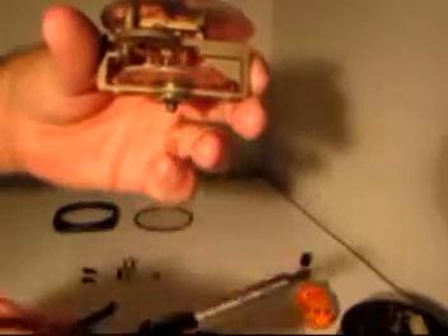Inflating it — that's all it takes. A small movement, a small expansion of that aneroid capsule, and the fine linkages will move the needle. Lots of adjustments for various things. There's a very tiny rack and pinion arrangement that actually moves the needle.